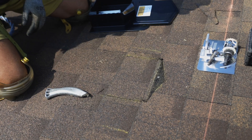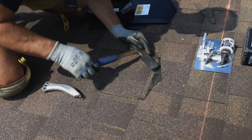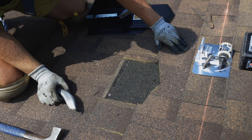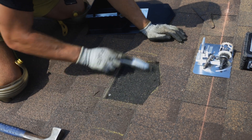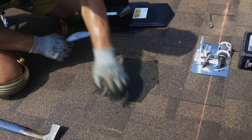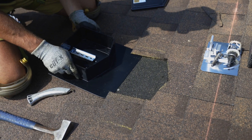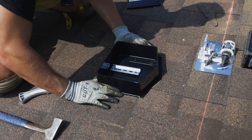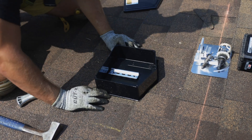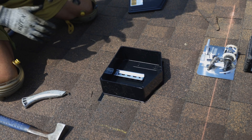As you can see there's kind of one nail sitting in there — I just like to pop that one out. The nail course for shingles is usually just on those edges, so you just want to check and see if there are any you might have to lift. We were fortunate here and won't have to lift anything. You can always just slide it in to make sure it's gonna fit. I like to have just a little bit of space for water to run — a quarter inch is good. So that's your pre-cut, and we know it fits.